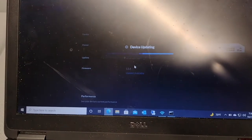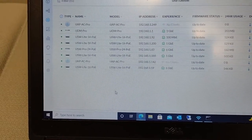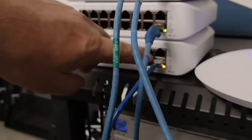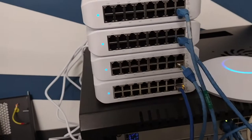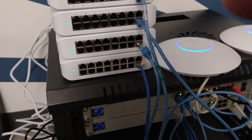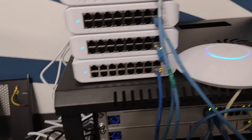If you're new to cabling: Cat 5 wire can only handle 100 megabits, Cat 5e can handle gigabit, and Cat 6 and above can handle gigabit or 10 gigabit. This one here is connected at 100 megabits — you can tell because it's blinking yellow while the rest are blinking green. It's an old Cat 5 wire. Cat 5e has more twists per inch and is typically heavier gauge to prevent crosstalk, which is why it negotiates at gigabit.